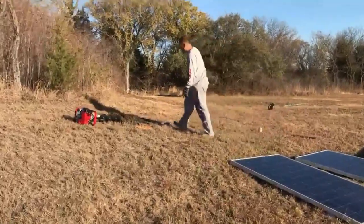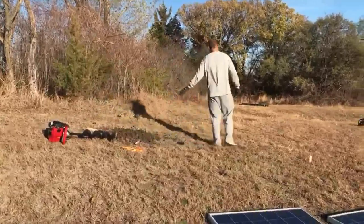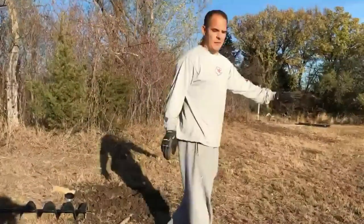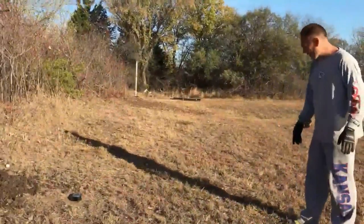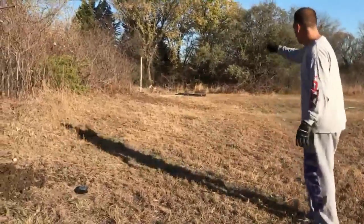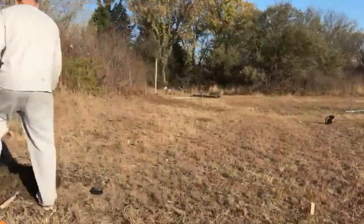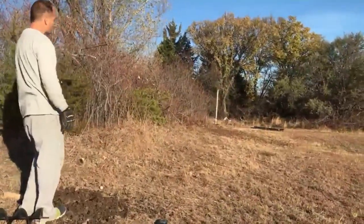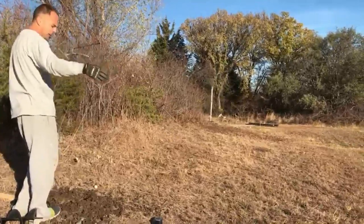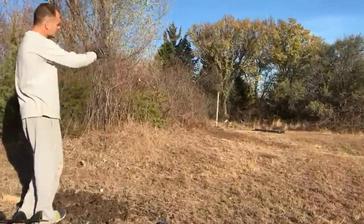You can see our first post is way down there, our second post is right here — 76 feet. So we took a measurement from that post to this post, which is 76 feet, and we knew how far it was over to here, which is 121 and a half inches or something like that. So we put a post or marker in the ground here, and another one down there. And then to get it so that it's straight, you measure from that post to this one, get a measurement, then do the same thing from this post to that one. Once you get these two numbers to be the same, then you know you're square — like 76 feet 5 inches both ways.